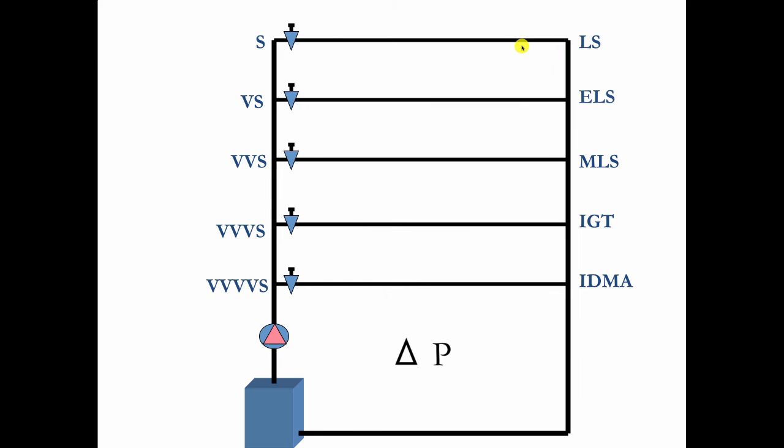And low flow means no heat, and you're going to go up there to that top floor with a key and a rag and a can, and you're going to bleed radiators that don't have any air in them. And when you bleed, you won't get any air. And when you don't get any air, you got to know that ain't an air problem. So stop bleeding.